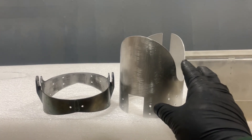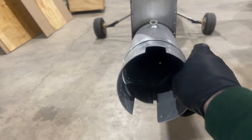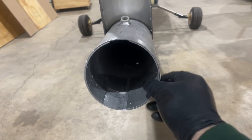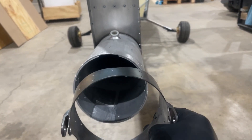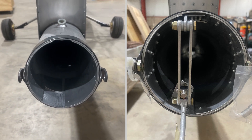This is the Titan Tornado stabilator — the stabilator collar and the doubler plate. The doubler will compress, fit inside, and then be Uralane glued and riveted. The mounting collar then slides on and will also be Uralane bonded and riveted.